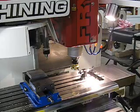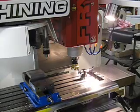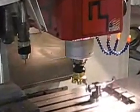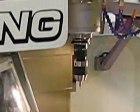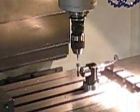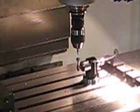The next step: I have a center drill I want to touch off — both the length and the diameter of it. From here, I can select a new tool from my tool library and pick my center drill. All I have to do is select a new tool and it will automatically come up and switch tools for me without me having to go to any G-code or MDI mode. It's going to work right off the center of the tool, and now that's set.